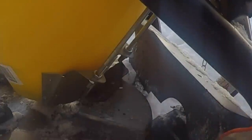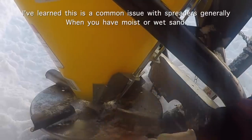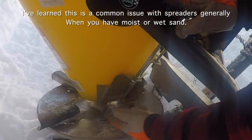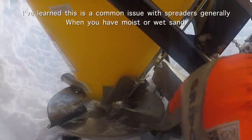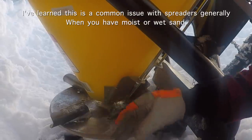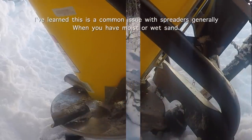The next important piece of information is that your two gates are here. And so what was happening last week when I kept shaking the tub is I had Guy take a look at it for me. And when you open up these gates, and as you can see, these gates can fully close or open up pretty wide. And as I said, you can open either gate at a time. So it fully closes. What Guy did is he took a look up there and also put a stick in. And what he said he could see is that the sand was domed, almost with a center that was totally empty, right on the inside of that tub. And so what it appeared to him is that the agitator that's in there was missing the sand, because the sand was kind of domed over and it wasn't falling back into the middle like I guess it had been the rest of the winter.